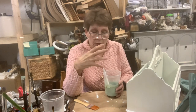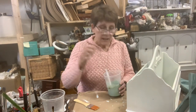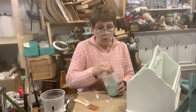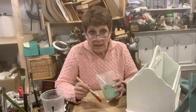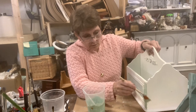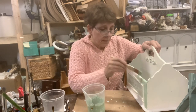You can make it a little thicker if you need, or thinner if you just want to stain. I like using warm or hot-ish water, and I like to add my milk paint to the water, stir it all up, let it sit for about 15 minutes, then stir it some more — it lets the milk solids absorb more of the moisture. This is a mix of Pantry Door and Sweetie Jane. I'm just going to get a couple of coats on here and see what kind of chipping we get happening on this one.